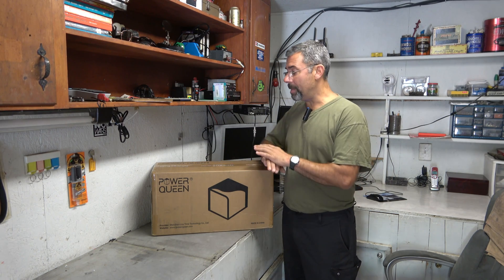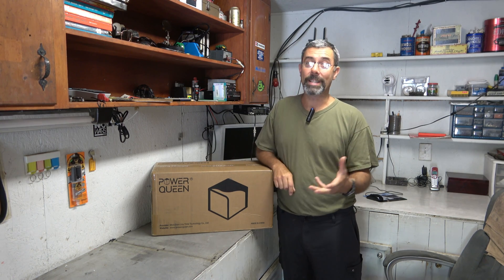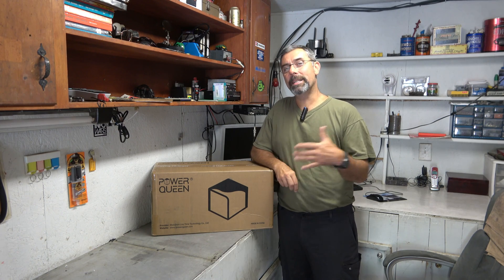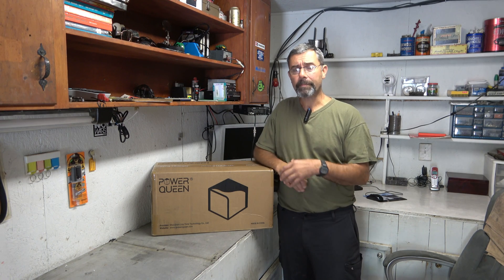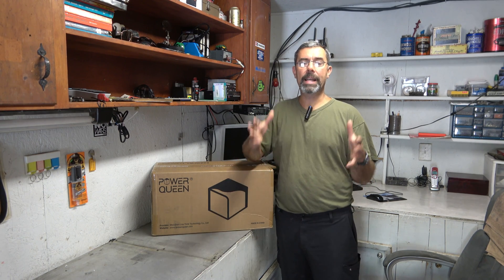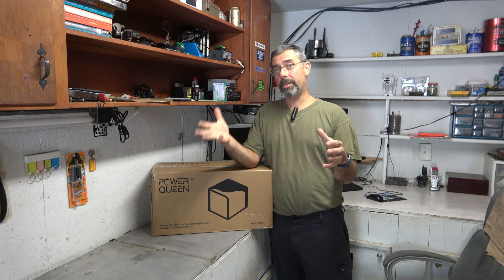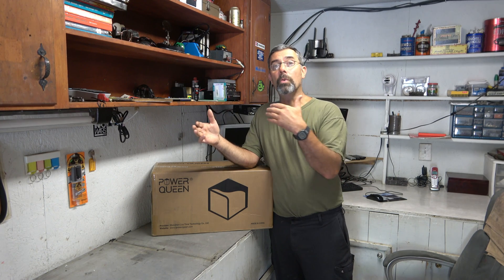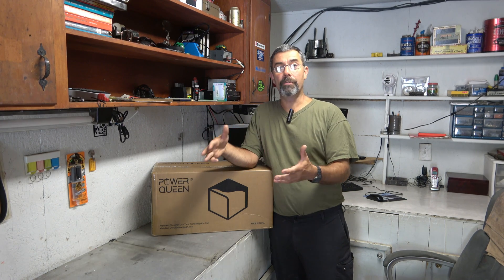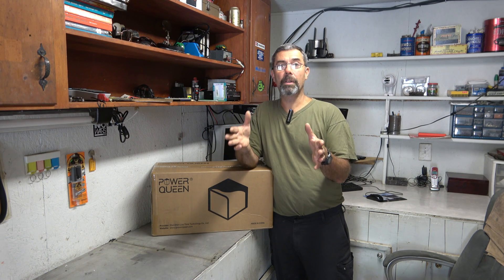Power Queen liked the video I made and they asked me if I was interested in doing a review of another battery for them. Of course, I said yes. I talked to them about what my system was — my system is not a 12 volt system, it's a 24 volt system. And I was looking for something larger because every time I get a battery, it's a 100 amp hour battery and I have to hook it to another 100 amp hour 12 volt battery, and I have to hook those in series. In order to do that in series to equal 24 volts, 24 volts 100 amp hours is what you end up with if you link two 12 volt batteries.